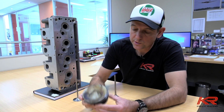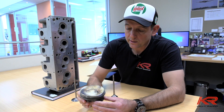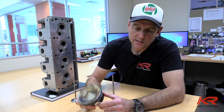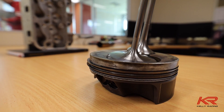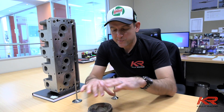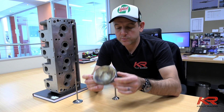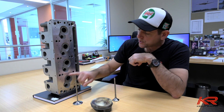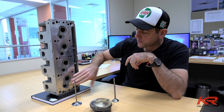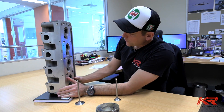What we aim to do is shuffle everything around in the head to try and maximize exactly where these things end up, for the best possible design. In general, you want it nice and light on minimum weight, the strongest design, and you want to get those rings as high up in the piston and the pin as well as you can. You'd be amazed how much load goes through trying to bend these pistons around - we want maximum reliability and performance out of the piston.